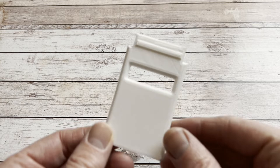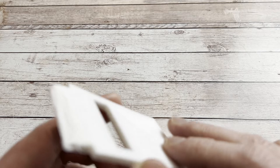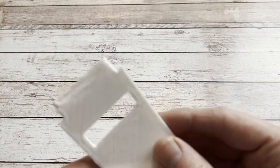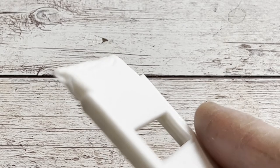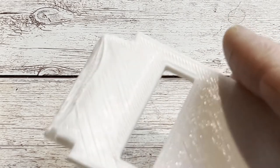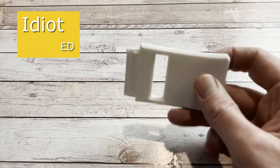I don't often focus on failed prints, but I thought I'd give this one a quick show because it's an interesting one. For some reason the back quarter of the lid here, which is part of the stand, has completely collapsed, and you can also see print lines all over the bottom where it hasn't quite bonded. I'm not sure whether it failed to attach to the print bed or whether it required some support, but yeah this was an interesting fail. It's properly squashed down — this is supposed to be a print-in-place, and I didn't print it in place. I printed several bits separately, so we're going to get rid of that one and try again.